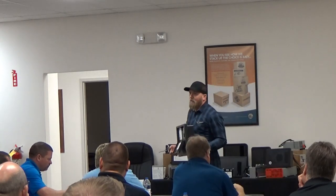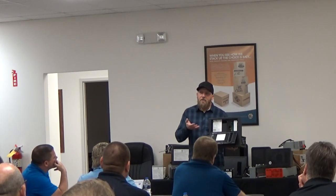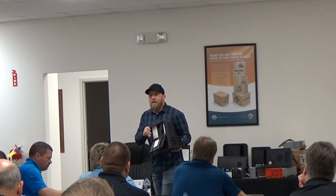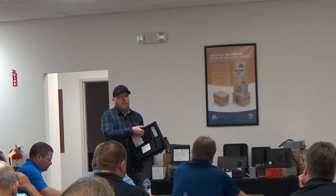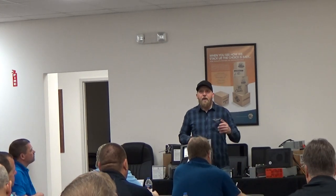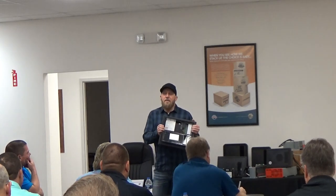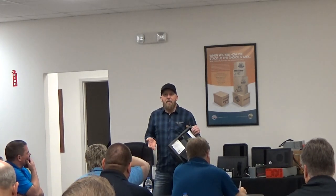But this one has a higher potential since those capacitors and circuitry need to be loaded. So the one thing you can tell your customers is make sure it's connected to a battery so the capacitors are loaded up, and that will limit the possibility of tripping the GFCI. Is that true with our competitors too? We're all converted that way. Yep. Just because of the way they operate and the way a GFCI is going to trip, they kind of butt heads together. So the way to get around that is to make sure this is loaded up in some sense, like by being connected to a battery.